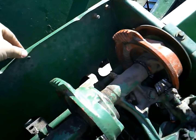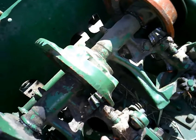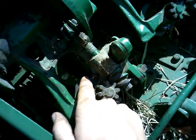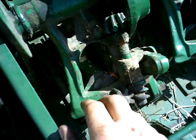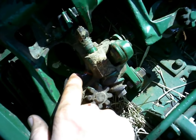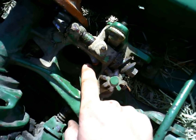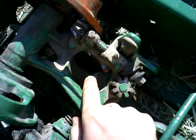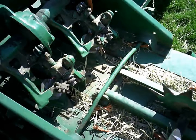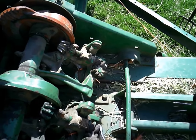I don't have a 710 or 720 service book — I have one for a 62T, which would be early to mid-60s. This is about a '72. They say on a 62T you need to have about an eighth-inch clearance between the rake — or twine disc holder maybe — between this piece and the left edge of the notch on the twine disc. That eighth inch isn't very big but it would let some twine flow through. I'm going to open this one up just a little bit and close this one a little. I'm not 100% sure on what it should be because I don't have a 720 book — that's for a different knotter, and they did change that knotter some between the 62T and the 710.